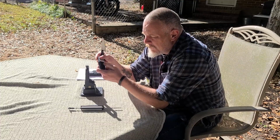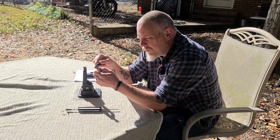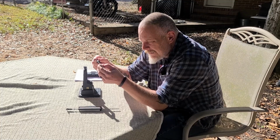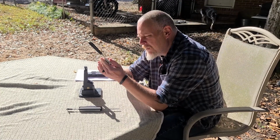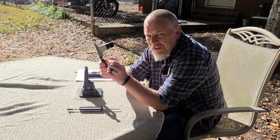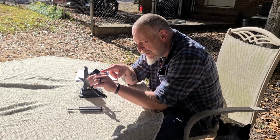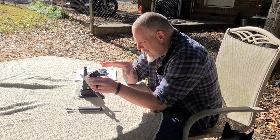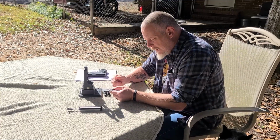So there's a thumb screw here. We open up the jaws, place our knife securely into it, and we find our middle point. It's adjusted a little bit so that it sits nice and even, and then we tighten that thumb screw up and get a good purchase on it, and that seems to be quite solid. Now, the Worksharp does not get held together by bolts or anything like that. It uses magnets. One of the nice things about that is it prevents you from really laying into the knife you're working on and messing it up.